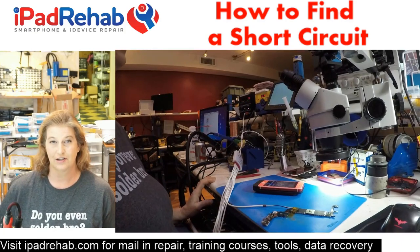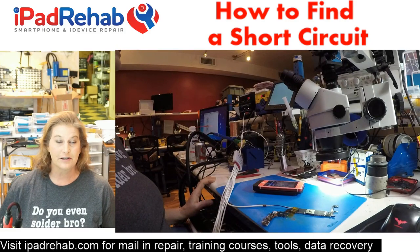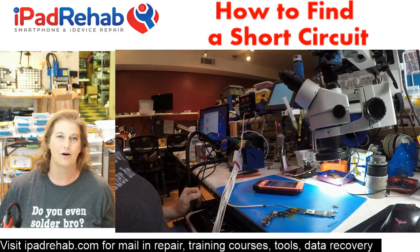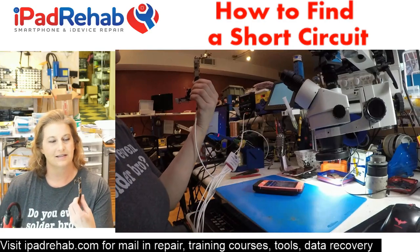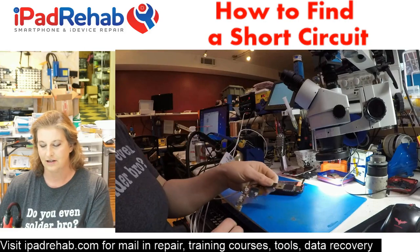a heat detection method. So we're going to compare the FLIR cam to freeze spray, which is the method that we do generally use, versus my favorite method, which is your good old fashioned face, always available, free, and also pretty effective. So the board that we're working on today, this is a 6S. This is a 6S that I believe has a short circuit.